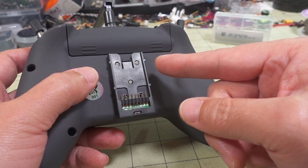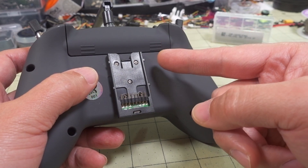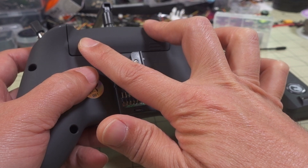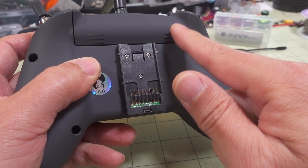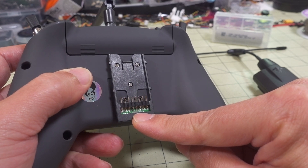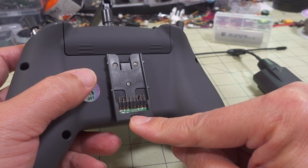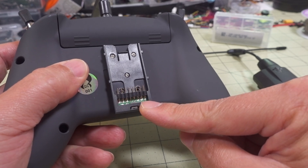In order to get the main PCB board out of the way — because that's what's causing the problems — I changed my wiring so it's directly wired from the main battery straight to the boost pack here, getting basically VBAT to the boost pack. I wasn't sure if it was going to be okay down to like 3.3 volts or so, and I did test it. It works down to 3.3 volts on this boost pack and it boosts up to 7.8 volts.